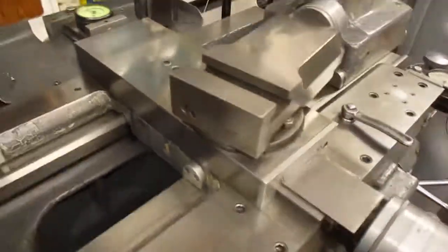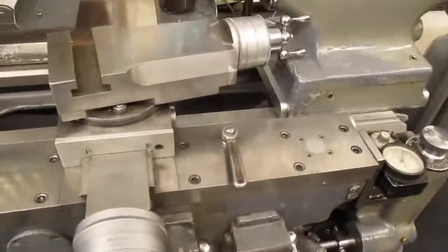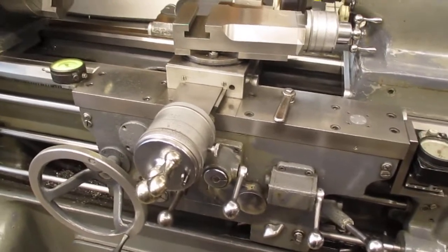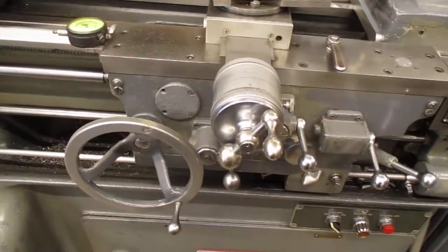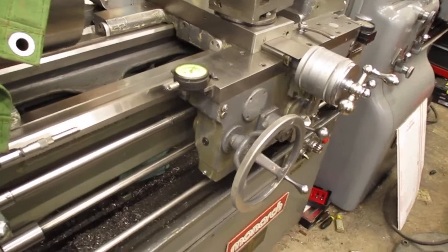I still haven't moved this carriage — I'm going to do the module sometime today and I don't want to move it. I want to pump it up with oil, get the machine running, and pump that carriage up, because it's stuck good. I can move it, but it's going to tear microscopic bits of metal off because it's rung to the ways.